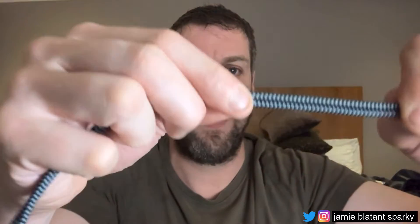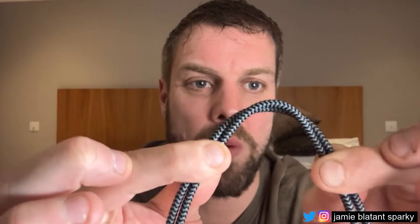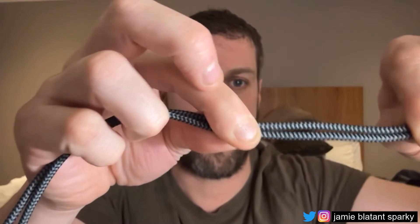The reason for that is: when I bend the cable like this, the core on the inside gets shorter and the core on the outside gets longer. If they were straight like my fingers, I can't bend them that way because one can't go longer. Let me demonstrate - grab two bits of cable like that and if I do that, you see how one has gone around the other - it's trying to push itself out. If twisted round, they'll bend without making any errors. Without the twists, as soon as you bent it, some cores would get shorter, the outside would split - in the trade that's called bird nesting.